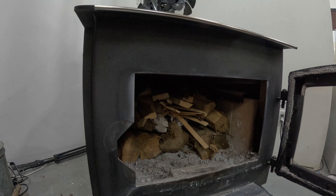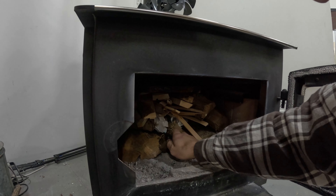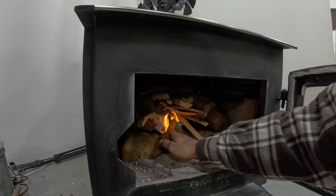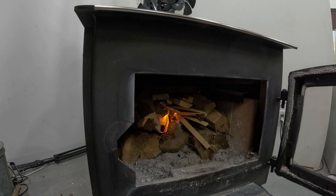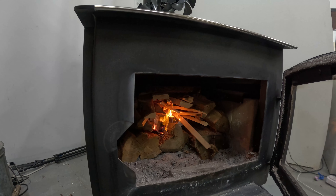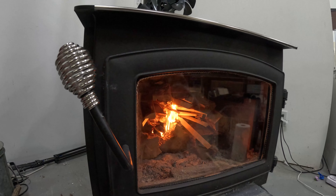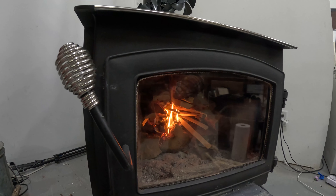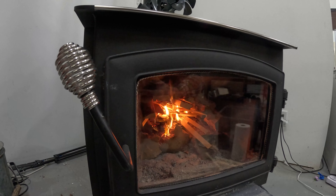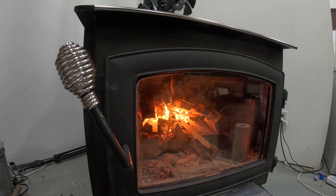Once I get it stacked in there good, just got to light that paper and we'll be ready to roll. I've got bigger torches, but I just like using this guy. So we're going to just let that sit. The manufacturer of this wood stove recommends that you start the fire, shut the door but don't shut it all the way — don't latch it — and just leave it sit with the door cracked for the first 10 minutes or until it gets up to a good burning temp. I usually leave the door cracked until it gets to about 250 to 300 degrees, and then once she's up to about 300 and she's looking like she's going to cook pretty good, then I'll go ahead and latch that door.